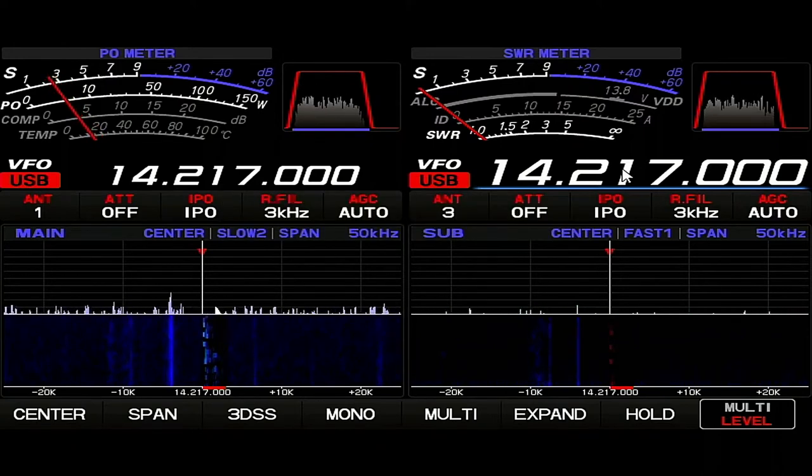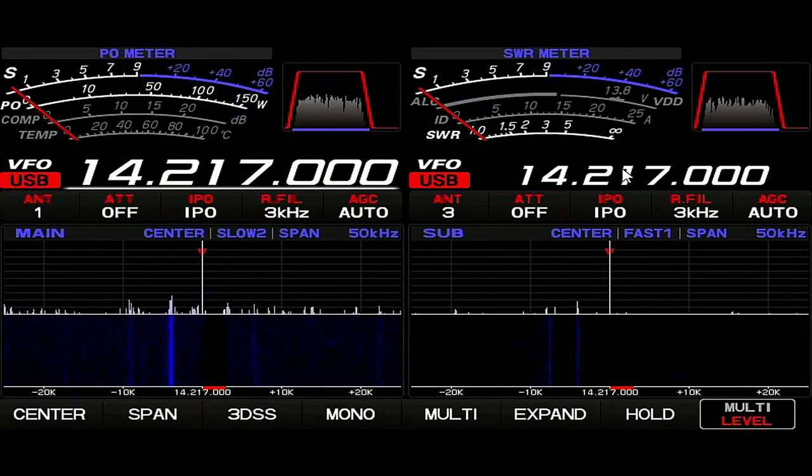And loops are going to be naturally resistant to noise, just because they pick up the magnetic portion of the electromagnetic wave. Okay? So here it is on the Wellbrook. This is on receiver B, so VFOB. If we move over to A, we're on Callum McCormick's DX Commander. You can see how this could help you if you're picking up fade.